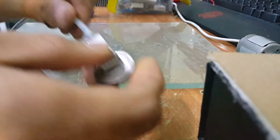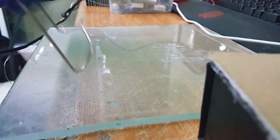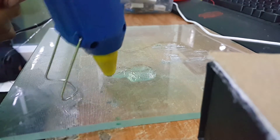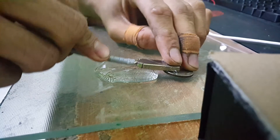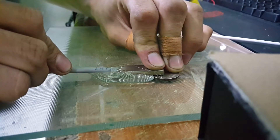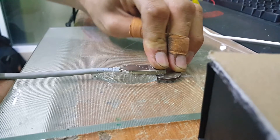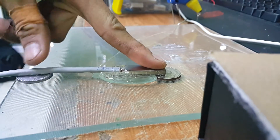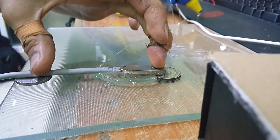The function of this piece of glass is so the glue can set without sticking — hot glue doesn't stick to glass. Now let's put a big block of glue here, make it a bit long. Then slowly put it down like this, slowly press it down, push it in and hold the cable to make it straight. Make sure there's some distance and it doesn't touch. Let's wait for the glue to set.